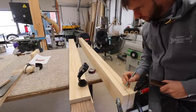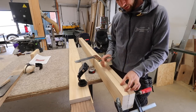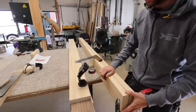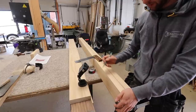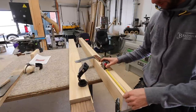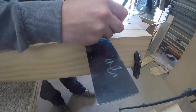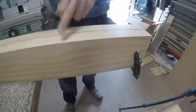The reason for that is if we ever trim anything off the door, the strength of the door in the bottom of that joint matters, if you're wedging against this piece of timber that's left. If that's too narrow and you take, say, 10mm off the bottom of the gate in the future, because it's not clearing certain stones or something on the floor, and you're too close to the bottom anyway, that joint's going to lose all of its strength. So always leave a decent amount of timber behind that wedge room on the bottom and top of the sash. So that's what I'm going to use for a 220mm rail: 50mm tenons, 55mm between them, and it leaves you with 60mm at the bottom when you've got that 5mm setback for the bevel.